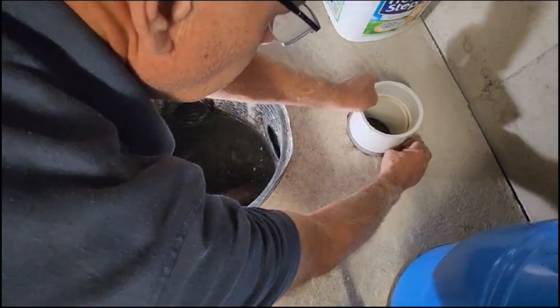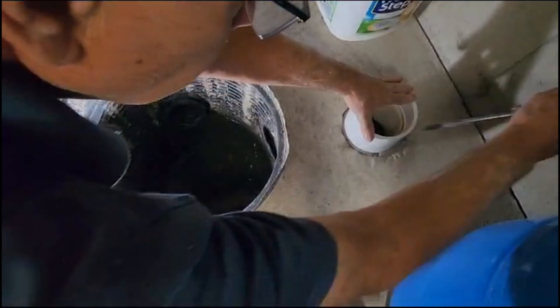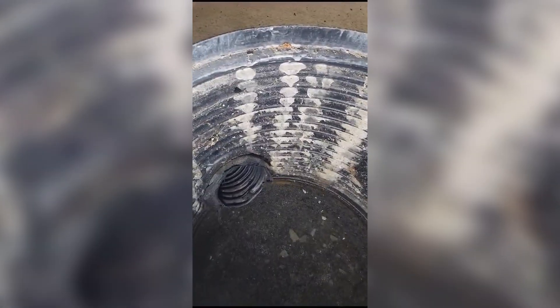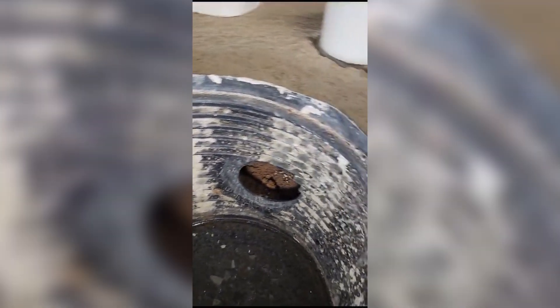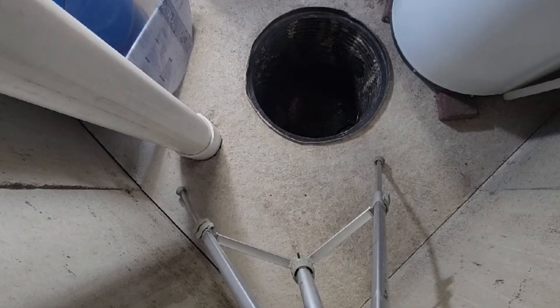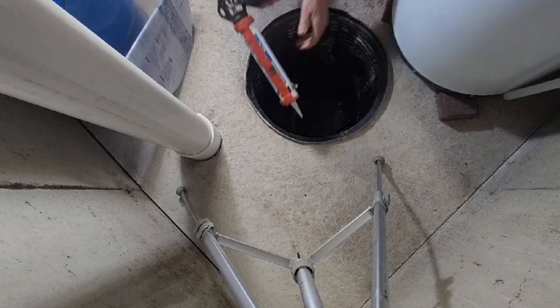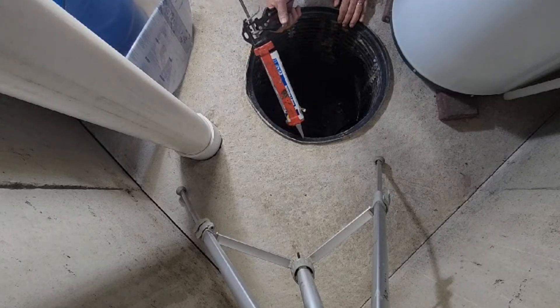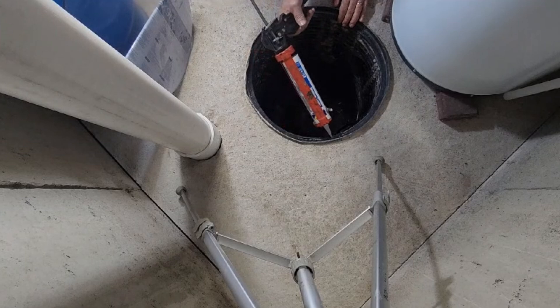So we drill out a four inch hole to connect to our suction pit, then we install our floor piece. Here is the drain tile and here is the hole leading to our suction pit. After installing the rest of the mitigation system, we then install the Lexan cover we cut earlier for our sump basin.